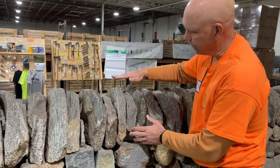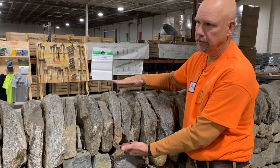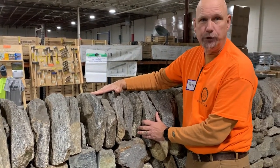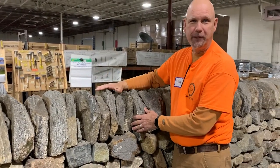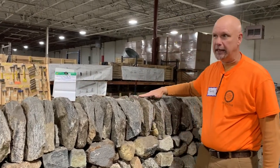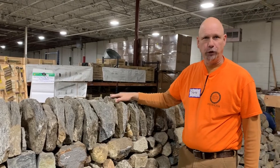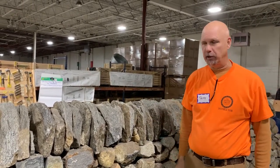The fact that these stones are put on vertically gains us a foot of height very quickly and provides a really stable top that prevents animals and children from taking stones off the top of the wall. The team has spent considerable time trimming it to make sure that it's got a nice flat edge on the top, and that's the key to making a stone wall look really, really good — having a nice clean edge on top of the wall.